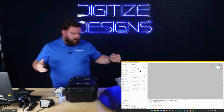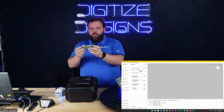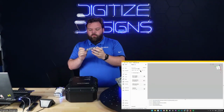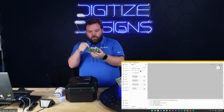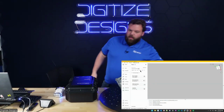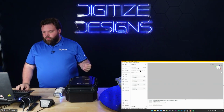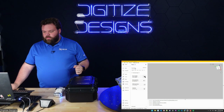You'll see things like on this little circuit board, for example, there's some stuff on here that if I scan this at a millimeter resolution, they're just not going to show up, or they're going to be very hidden away. There are just things smaller than a millimeter, the points could just skip over the top of it and you won't see that thing. But if you crank that resolution up, you can capture that fine detail. So we'll do something like a half a millimeter for this transmission housing here. Got scan targets and geometry, refine geometry, and calibrate.